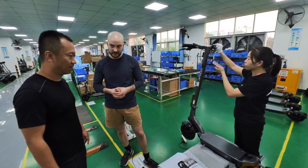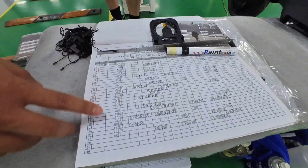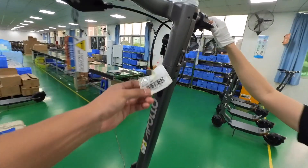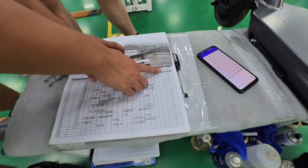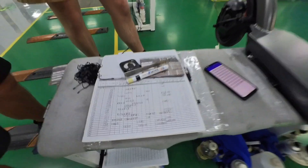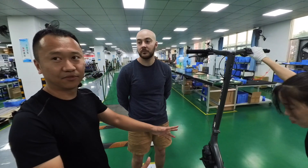When we find a defect, we have this tracking sheet. We do 100% scooter inspection — this is the scooter ID, and each scooter has its own serial number. We take down the serial number and put it on the tracking sheet, then write down the exact defect. If it's something that can be fixed, we send it to the repairs at the factory. There are two check sessions: the first is 'repair in progress,' meaning it's put in the repair spot and being reworked. Once reworked, they bring it back and we go to that same serial number, check that same scooter to make sure the rework is done and acceptable, then do another check confirming repair is done and everything's okay.